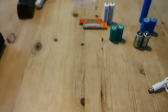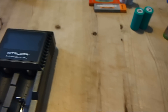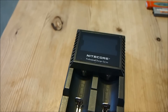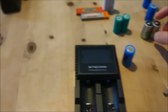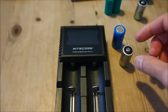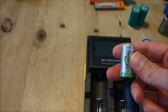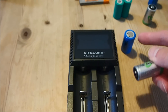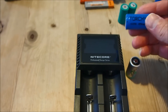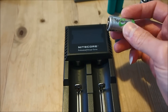By now I'm sure you can already guess that is the reason why the charger has a special charging mode for LiFePO4 batteries that needs to be accessed manually through the button on the side. The reason for that is the charger will not know whether you are charging a lithium ion cell or a LiFePO4 battery based on its current voltage. And if you do charge a LiFePO4 battery without telling the charger, it will try to charge it up to over 4 volts — the full charge voltage of a standard lithium ion battery — and that will lead to damage of the LiFePO4 battery.